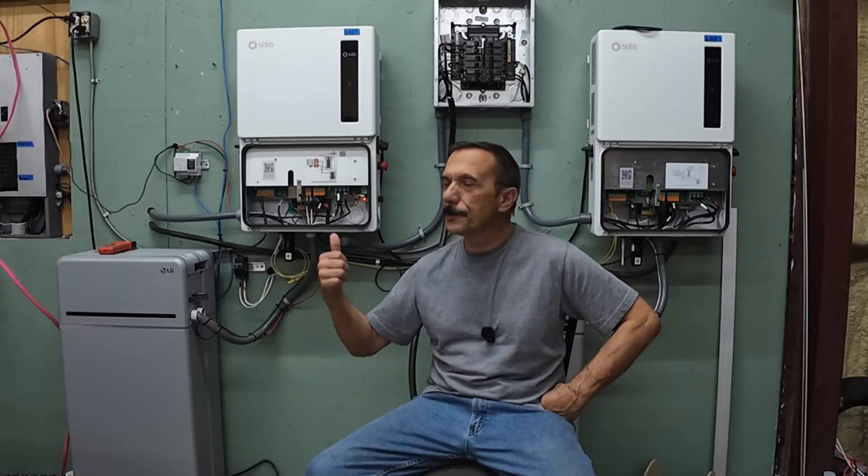I've done a lot of stress testing on these Solis high voltage inverters. I've got three altogether right now. I think I have over 50 videos on the Solis S6 line, ranging from how to set up and configure for off-grid, grid tie, with and without batteries, configuring a microgrid, how to parallel them, even how to run them off a Nissan Leaf battery. The one out in the shed is leading a pretty hard life — I like to say it's under a perpetual stress test. Every day it's just running Bitcoin miners. As long as there's enough sun it's running 10 or 11 kilowatts all the time. I think it's been running on my automation over 10 months now. The miners start up automatically in the morning when the SoC preset is hit and stop in the evening when the low preset is hit.